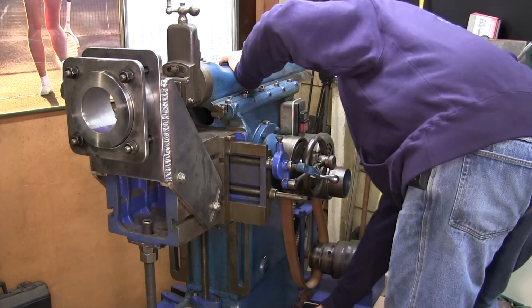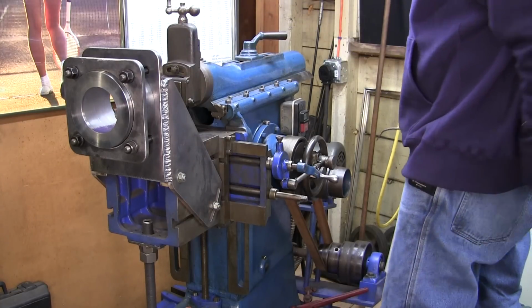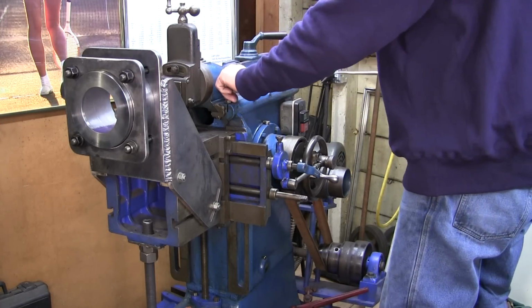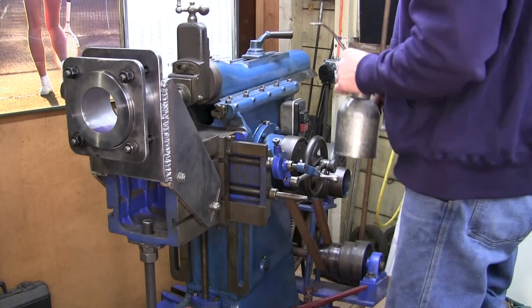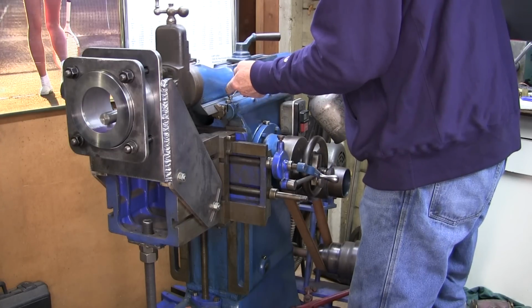All right, we're gonna let the tension down on our machine. The most important thing of your machine is to lube it up before you run. I've got a little bit squirting each one of my little oil cups here, but I'm gonna let it run for a little bit, and I'm gonna feed some oil in here and really let the thing juice up here.